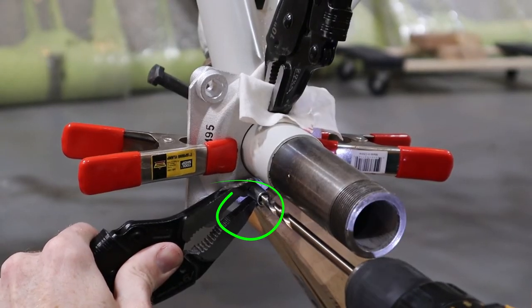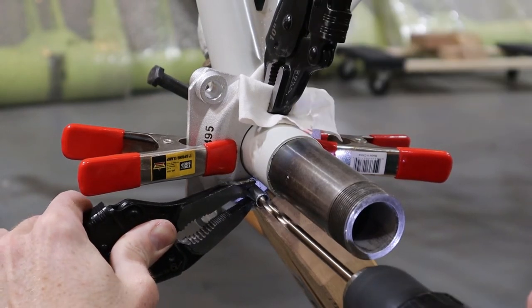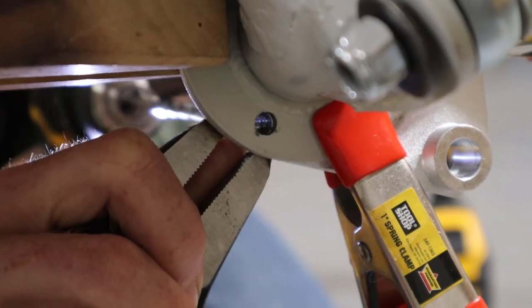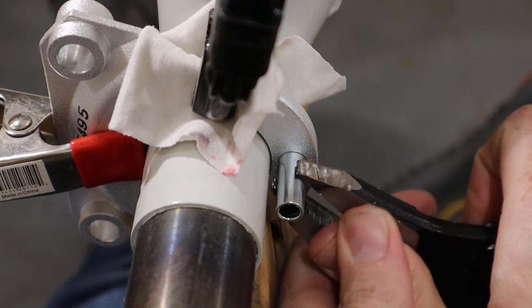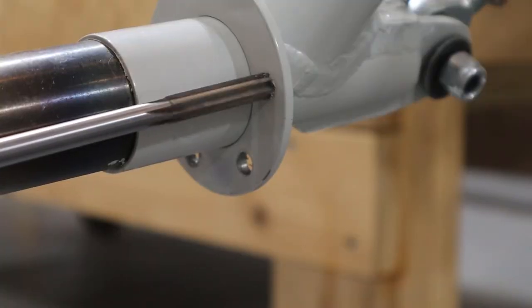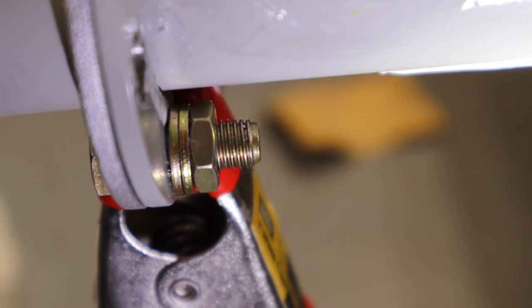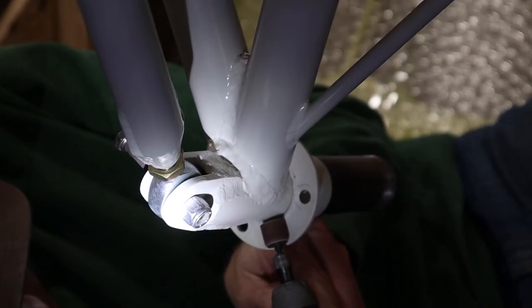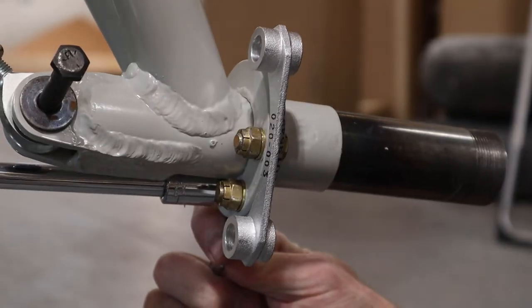With the main gear in place, I installed the torque plate for the brake calipers. To attach the torque plate I clamped it in place and used a 3/8" spacer to perfectly center a quarter-inch drill bit in the hole. These are cheap from a big box store so I used a new one for each hole. The instructions said only three or four holes needed to be drilled out, so I used four. Once the holes were drilled I used a reamer to make them final size. Next I used a Dremel to remove a small amount of weld directly below the washers to allow them to lay flat. After a little touch-up paint and primer had dried, I installed the torque plates.